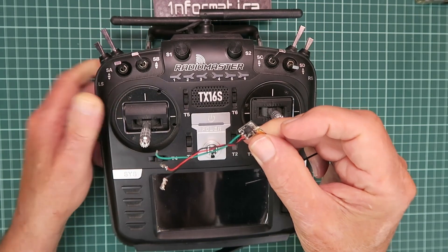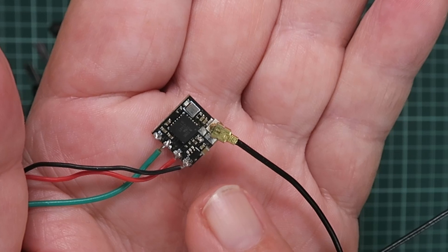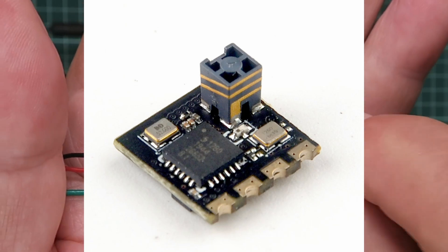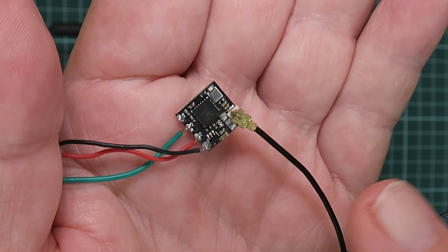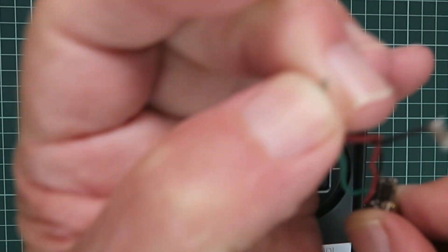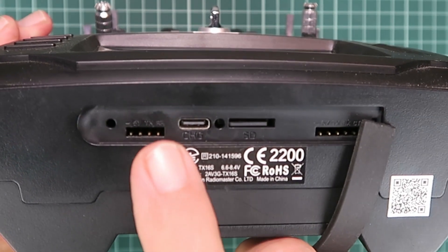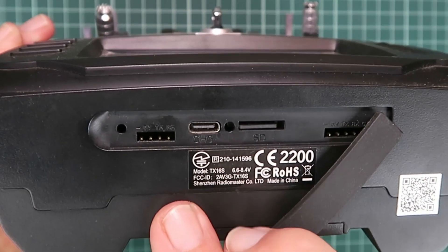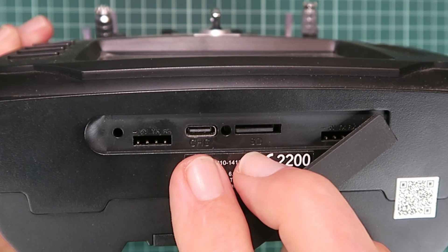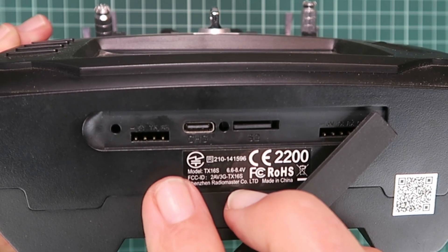I like these a lot, not only because they are so tiny. This one is a BetaFPV Nano, and in the Pocket I have a similarly sized Happy Model EP2 that has a ceramic antenna. I've temporarily put on some little connectors so I can plug in to the AUX port on the RadioMaster. The AUX port we're going to be using is AUX1, which is on the bottom underneath a rubber cover, clearly marked with Plus5, transmit, and receive.